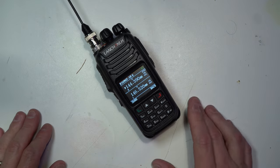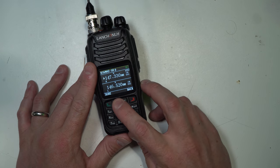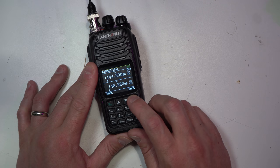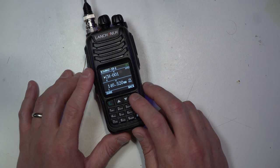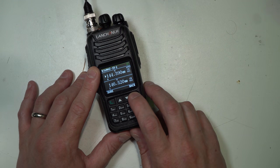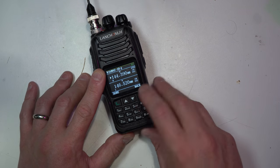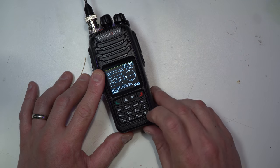On the side is a Kenwood connector, and yes, a standard FTDI cable works with this radio just fine. You can change your channels via the arrow keys. Pushing the red button allows you to exit or back out. If you hold it down, it enters a channel name mode — that would be the name you gave the channel in Chirp. Hold it again and it brings you back to the frequency. Hold it a third time and you're in VFO frequency mode — this is how you get into VHF or VFO control.